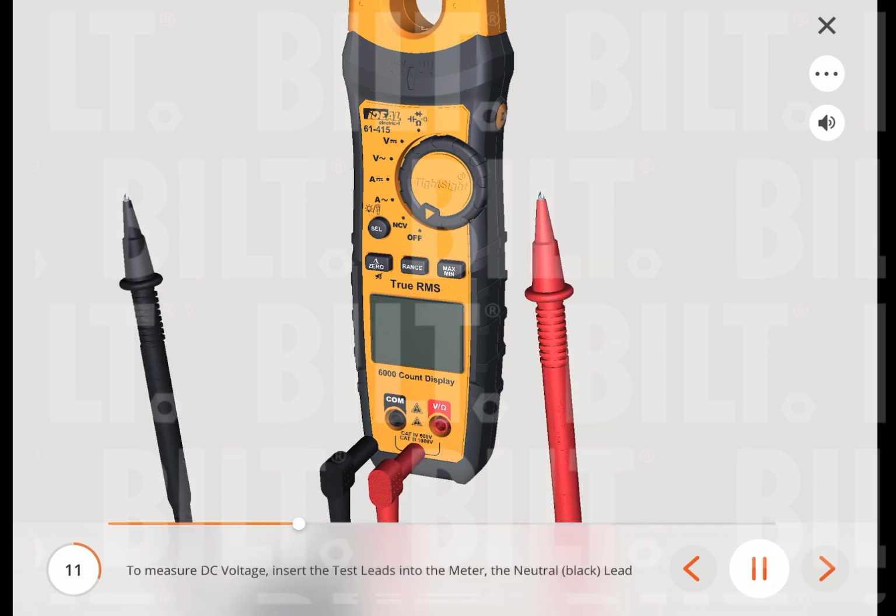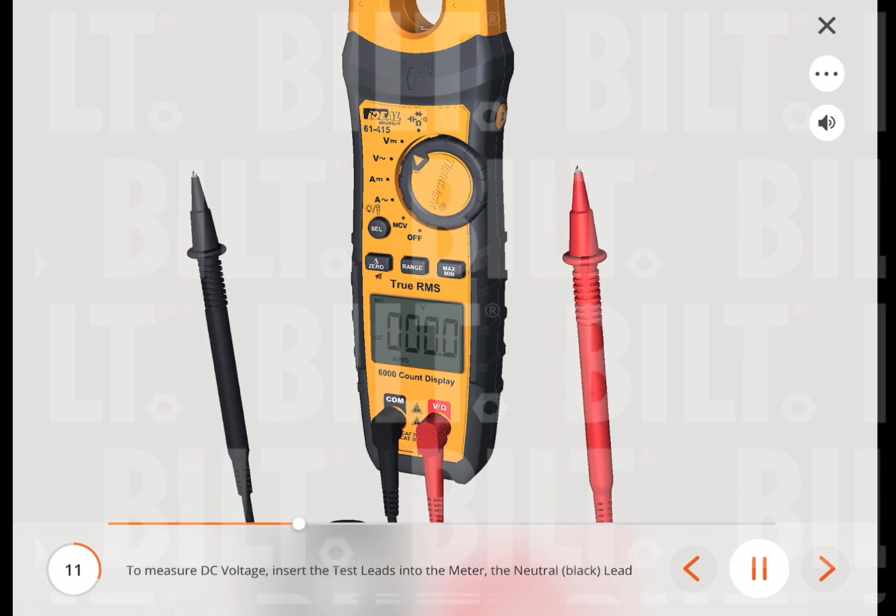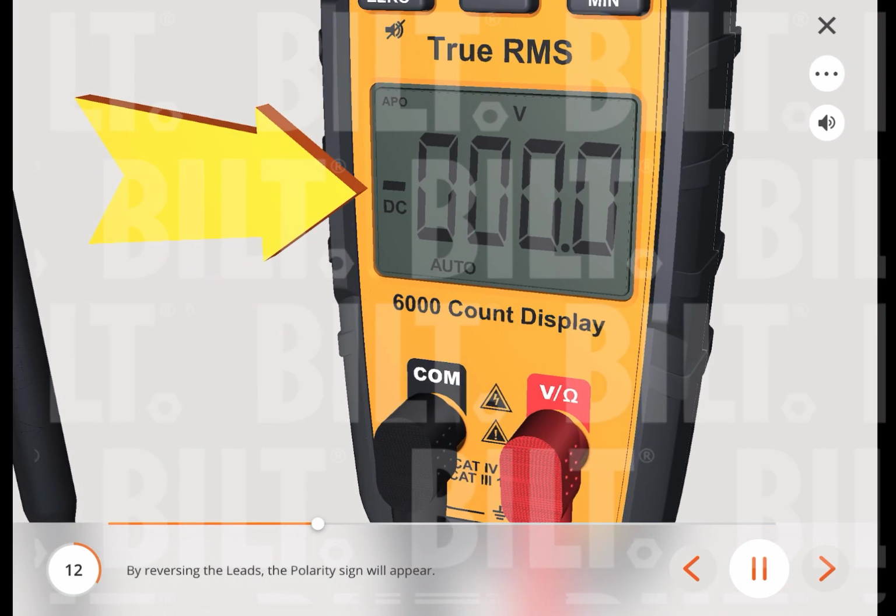To measure DC voltage, insert the test leads into the meter, the neutral, black, lead into the common terminal and the test, red, lead into the DC voltage terminal. Turn the function dial to the DCV function. By reversing the leads, the polarity sign will appear.